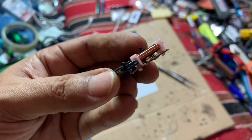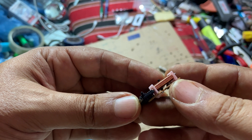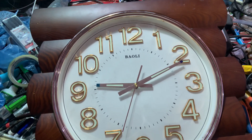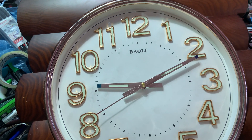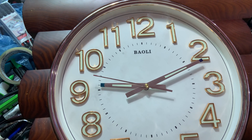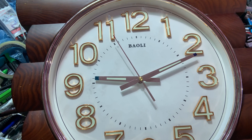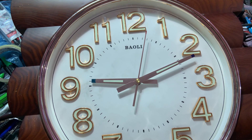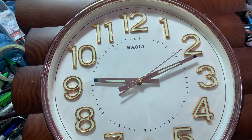We will open it and look at the coil — it's all related to the coil. The coil should have no less than 2.2 kilo-ohms as resistance. That way it helps conserve and save power because it won't draw so much current from the battery. A lower resistance coil will consume the battery faster. You may increase the coil winding if it is short — add more wire to the coil to make it at least 2.2 kilo-ohms — or you may put a resistor in series within the circuit board.